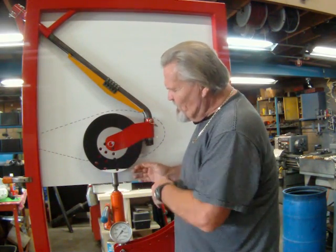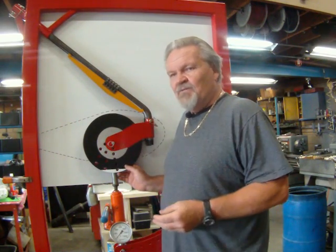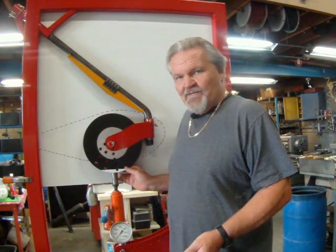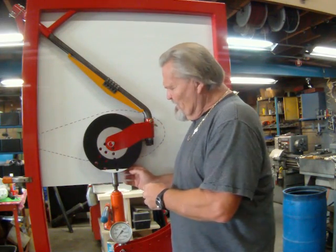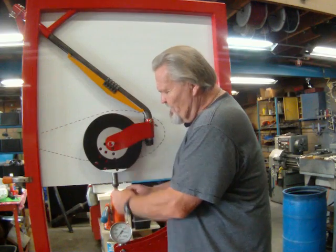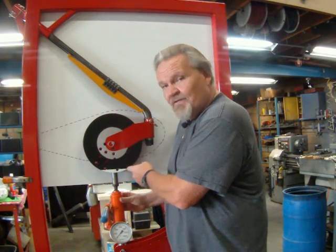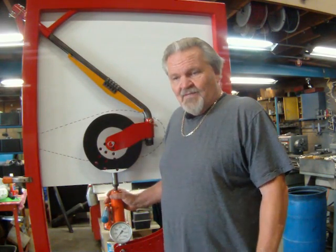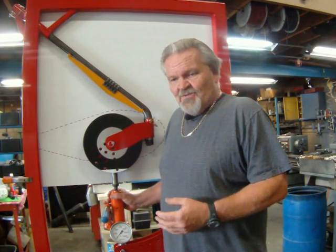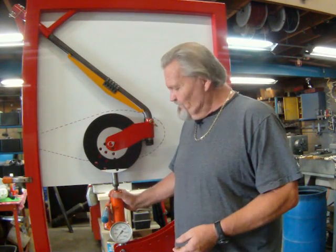So when you are on the ground, say taxiing with the full nose weight on the airplane in a forward direction, the push isn't straight up and down like this. It goes from this edge of the contact patch to the center line of the axle, which puts a different force on it than's on the airplane when it's just sitting still.